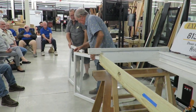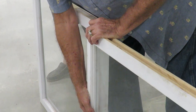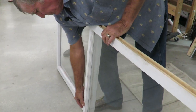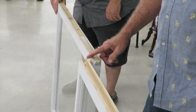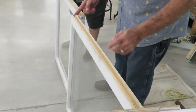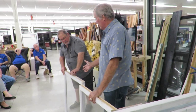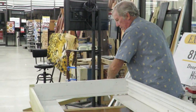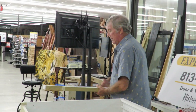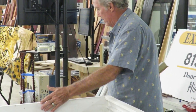Here's how they go together. This is called a check rail — you want this to level off with the upper sash. They overlap by about 1 and 3/8 of an inch in the middle. The lower sash measures 34 and the upper measures 33, but the glass size is exactly the same. This is also pressure treated — a piece of 2x6 with a 10-degree bevel cut to conform to the finish sill.